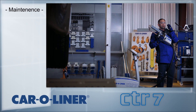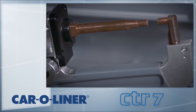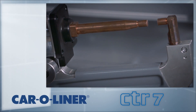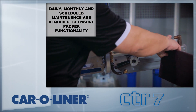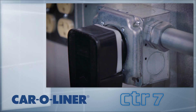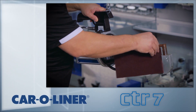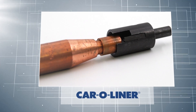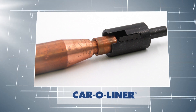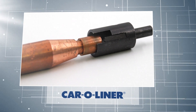To ensure the CTR-7 is always in working order, proper maintenance is required. Pay close attention to electrode caps. The cleanliness and shape of the electrodes are critical to the quality of the weld. Before beginning to clean the caps, unplug the machine as a safeguard. Periodically remove buildup on the caps with a Scotch Bright Pad. For more severe buildup, a tip dresser or flat file can be used, taking particular care to maintain the shape.